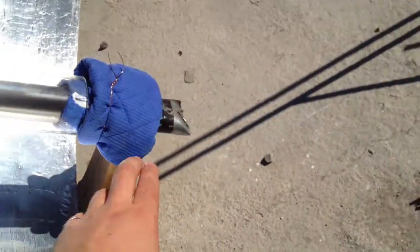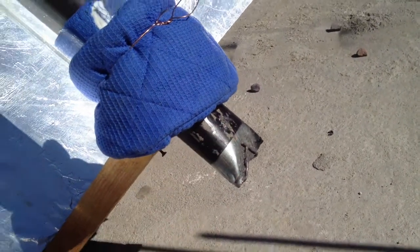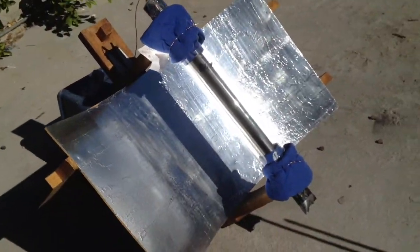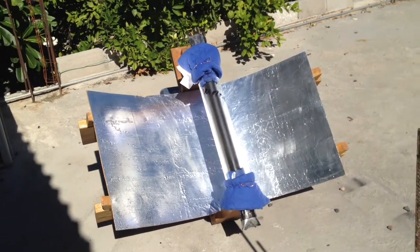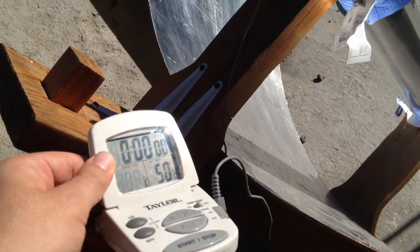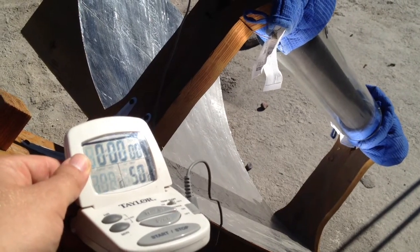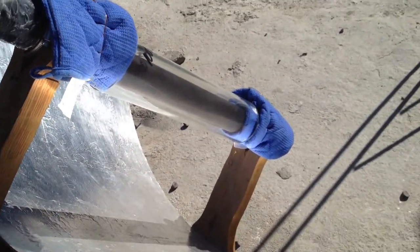There's heat loss all over the place where sun energy isn't coming in. Also the bottom is just bare, so this is extremely hot with no insulation there. So in the solar powered car I'll be getting a lot more power, and it really shows that it's possible to run a high-powered steam engine from this type of solar thermal device. A lot of light is spilling past the tube that doesn't hit it — that's just because the accuracy of the curve and the tin foil mirror aren't good enough. And here I have the highest temperature reading I can get out of this oven thermometer — it won't show me 200, it'll show 'high'. So I'm just about to max out this oven thermometer. It's pretty amazing that you can get this much heat from the sun.